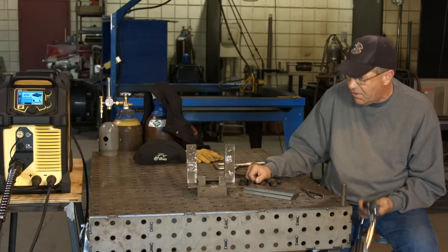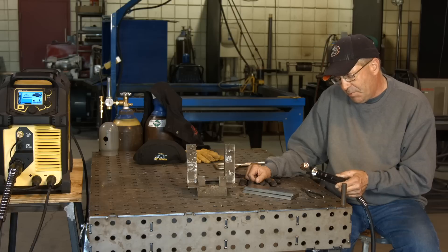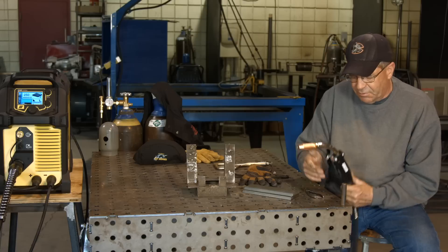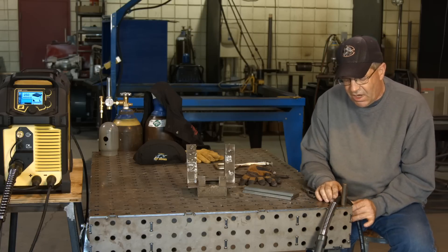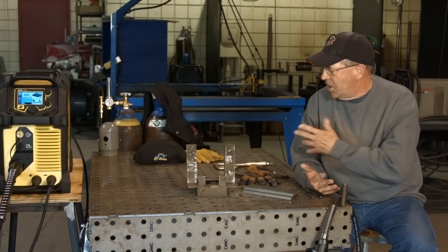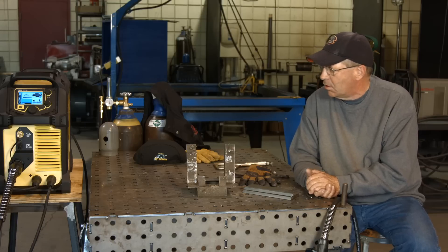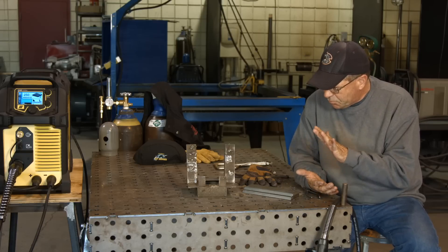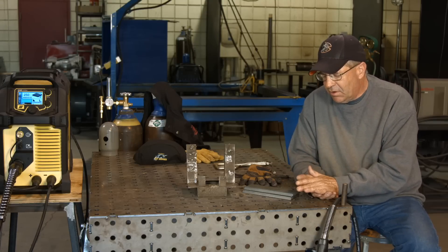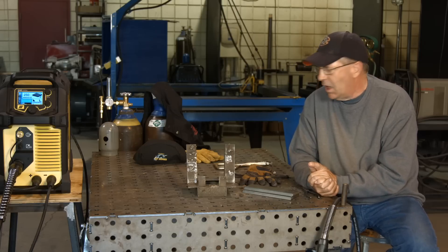I do know that this machine has a lot of great features. This is a cool gun — the Spraymaster Tweco gun, very comfortable. This machine offers a full range of 035 wire, both in short arc and obviously globular spray. If we just change the gas, we'd spray on it. I want to get these plates prepped: 30 degree bevel angle, C25 gas, about 20-25 cubic feet per hour.